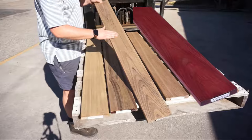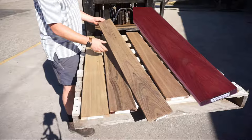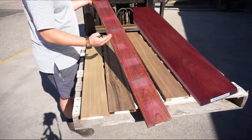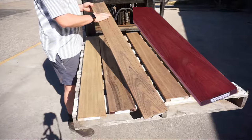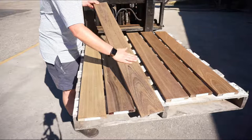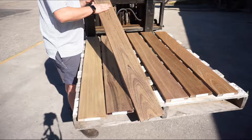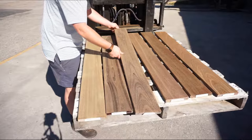Here is Purple Heart. Purple Heart is nice and very smooth in texture. You can see some of the sap has already surfaced and is now flaking away — if you take a fingernail and go over it lightly, it flakes right off. We've lost all that original purple color. Put up the image there so you can compare it to what it looked like when it first went down. It still has substantial purple coloring on the back. All the purple on the face is gone — it looks almost the same as Ipe, a little bit lighter. It still has that really nice grain pattern that you won't find on any of the other species. Over time, this sap will continue to flake away, but you can't feel it at all.